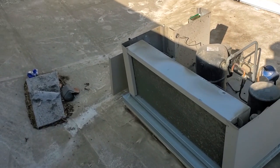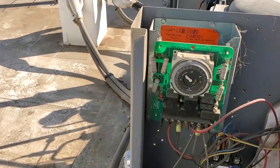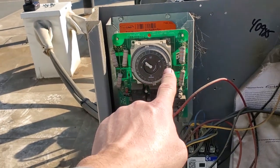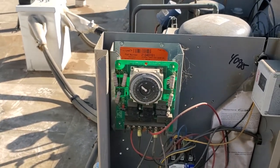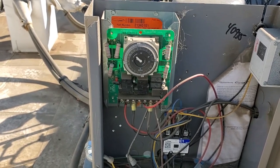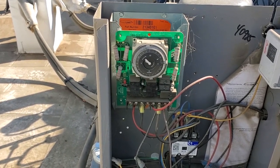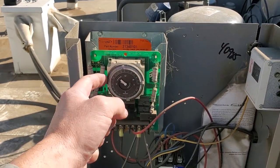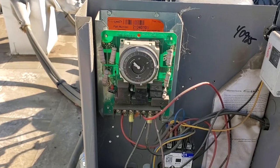As I was leaving the walk-in, it satisfied — I could hear it. Coming up onto the roof, I have a feeling the unit was in a defrost because they called me about an hour and a half ago. It looks like it just came out of a defrost, but on top of that, the defrost is too long on this unit. This is a hybrid walk-in cooler with a freezer coil — it shouldn't be running a 45-minute defrost. There's likely something going on with the limit switches. There's no need for a 45-minute defrost; you only need a half-hour defrost in our area.